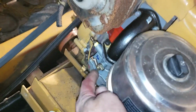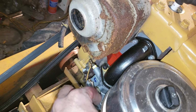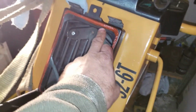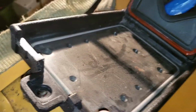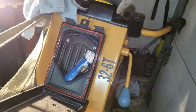You have to flip the governor pin to the other side. So that was a son of a bitch. But I went ahead and got everything else done on this thing, just about. I put some RTV in the little galley here, so when these two seals meet, this thing will be 100% watertight, just because that's where the owner's manual goes and everything like that.